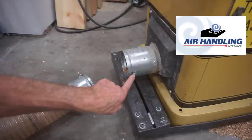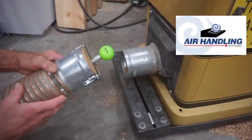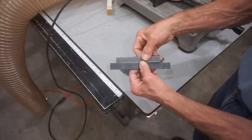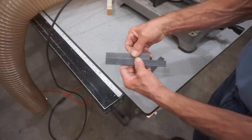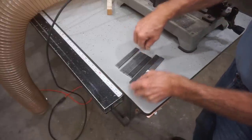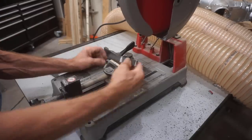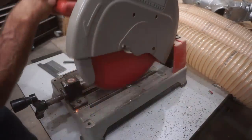Since I have the female part of the QDs attached to my machines, I made the hanger discs so they clip onto the male part of the fitting. These clip bars are made from quarter inch by three quarter inch flat steel stock cut to five and a half inches long for the four inch duct, and to seven and a half inches long for the six inch duct size. I put a mark one half inch in from each end of the bars for a groove that the QD clip can engage. I use a wood spacer block in the clamp of my Milwaukee dry cut saw to hold the bars in position for cutting.